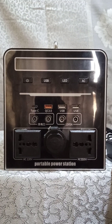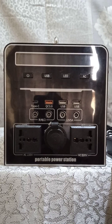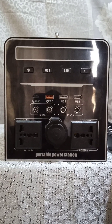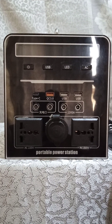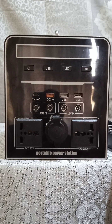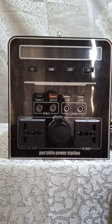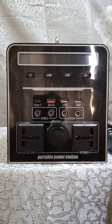So that way he's able to switch on his generator, charge the portable power station for five hours, leave it to run overnight, and any time utility power comes the charger continues charging the portable power station. And if there's no power, because he now has 1500 watts, he's able to run it all through the night to the morning.